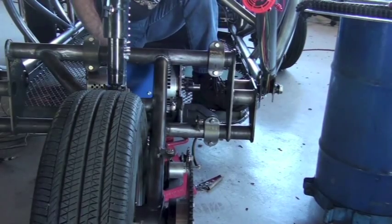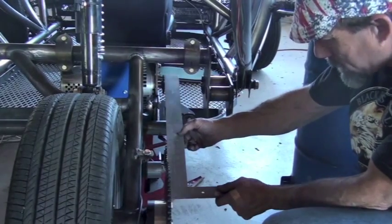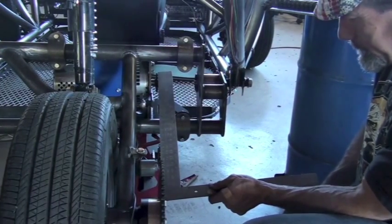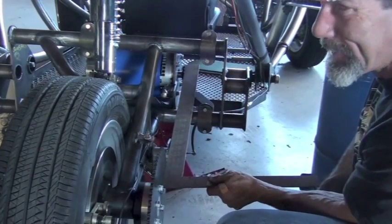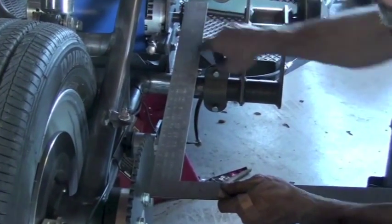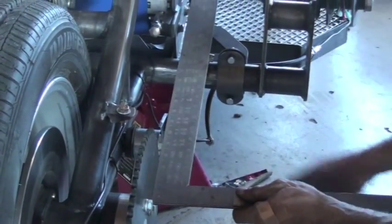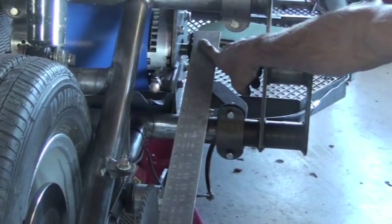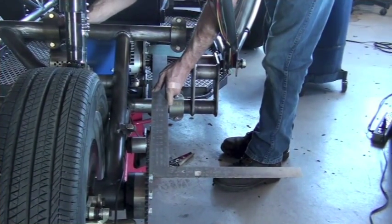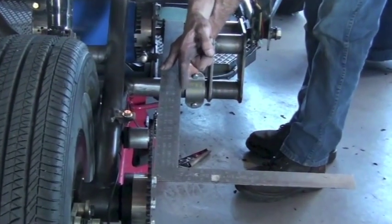With all the brackets attached but not firmly tightened down, we're going to align the drive sprocket from the motor and the drive sprocket on the wheel. We do this with a straight edge that reaches both sprockets. Our goal is to make certain that there is no space between any of the edges of the straight edge and the surface of the sprocket. You can see we've got a nice good connection, meaning we have good alignment between both sprockets front and back. If we did not have good alignment, we'd start to see space between the straight edge and the face of the sprocket — and this is what we don't want.